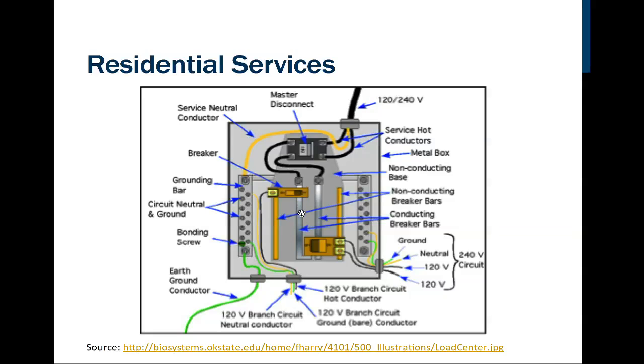So you'll notice then that this bus bar, right, this is called a bus bar right here, would be connected to this breaker, and we've got this lead here, this black lead, this is going to go out to a branch. And by a branch circuit, I mean one of the rooms or an electrical outlet, or perhaps a lighting circuit. Notice also that there's a yellow wire, and that yellow wire ties up here to this grounding bar, the same place as the neutral got connected. So from this terminal here, the black wire, to this terminal here would be 120 volts. I want to point out now that at the bottom of this bus bar on the left, notice it curves around the corner and hooks up at the bottom, right? And notice that this circuit breaker that's plugged in here has 2 screws on it, where this one up here only had 1.